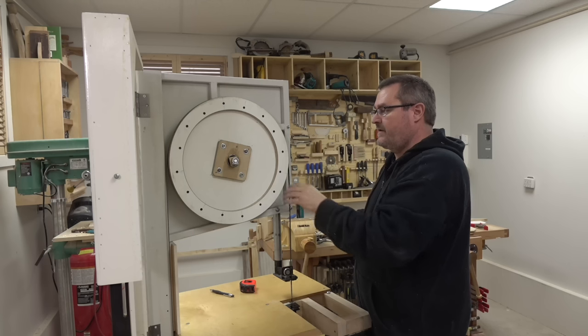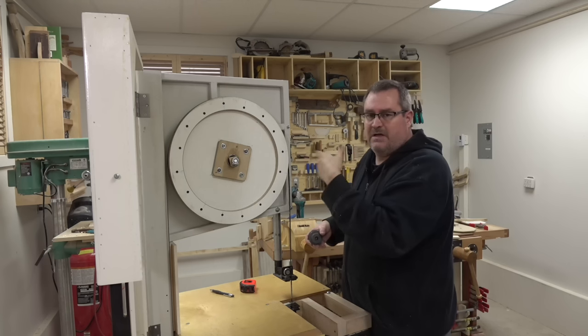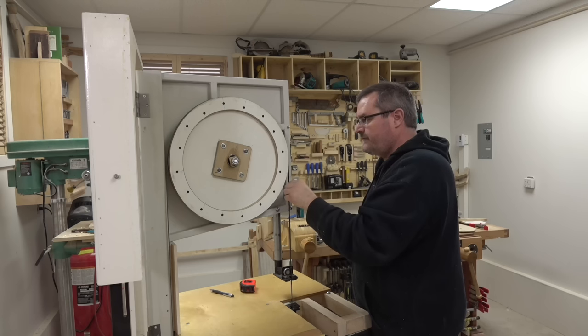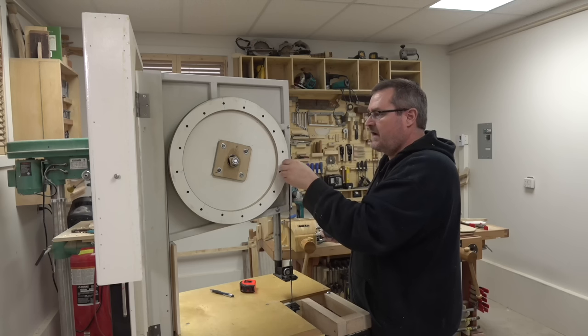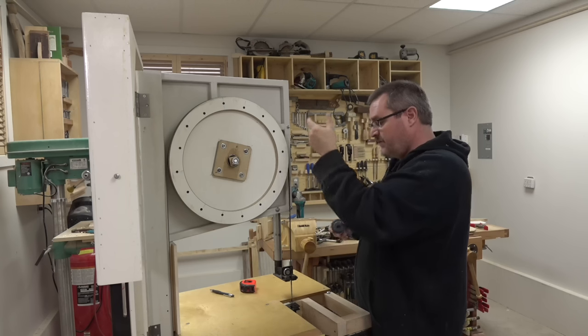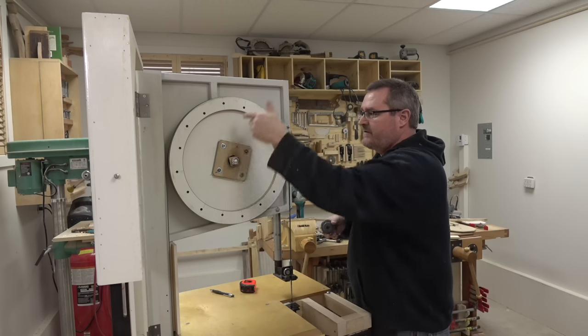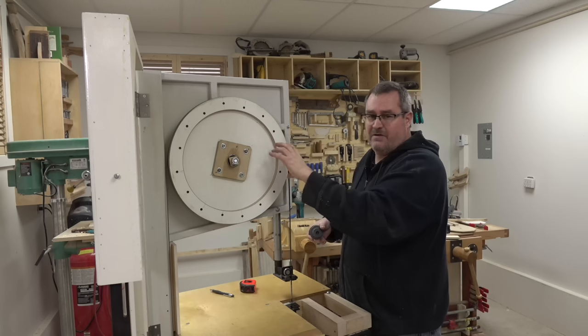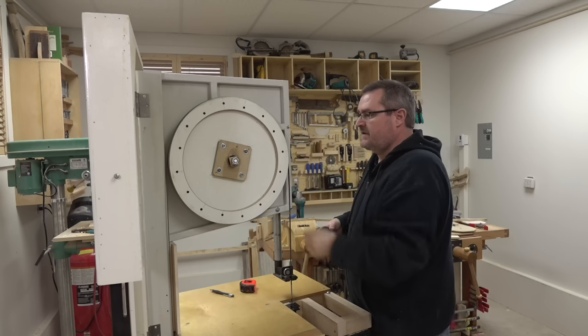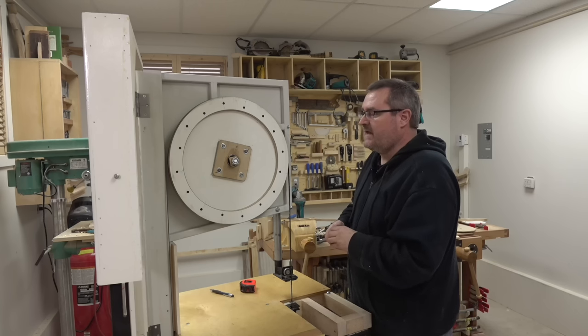Obviously, you need more bearings, but my concern would be the speed of the bearings. I don't know. I'd have to do some calculations on how fast each wheel would be turning, because the blade itself turns fairly fast. And it's one revolution of this wheel, but it would be several of a smaller wheel. So that would multiply the speed right there. Tracking wouldn't be that difficult either.